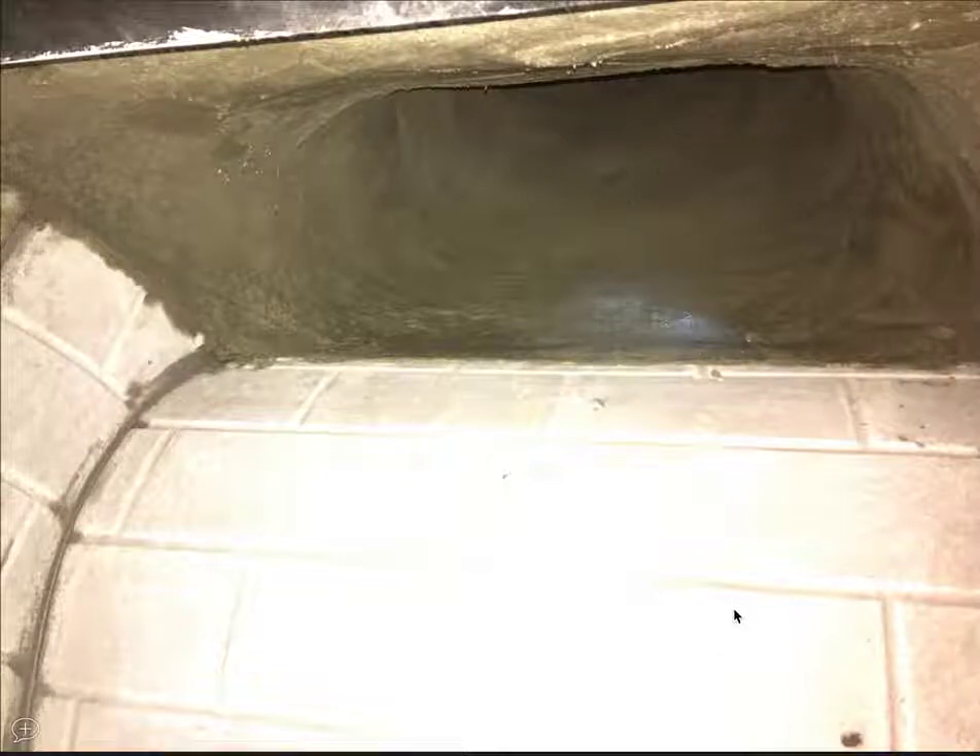The flue itself showing a lining, and then looking up from here you can kind of see how this back wall bows — they do this for how conducive the firebox itself is for flow. Notice this parge coat is very, very smooth, with everything funneling the smoke up to the new flue lining.